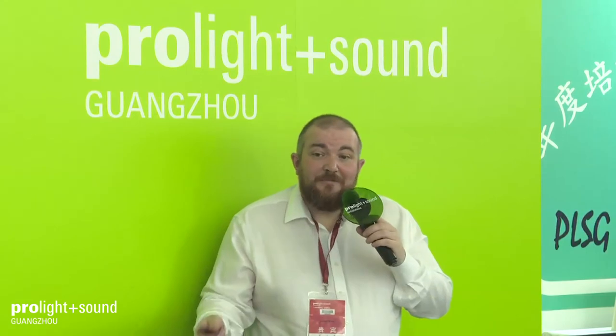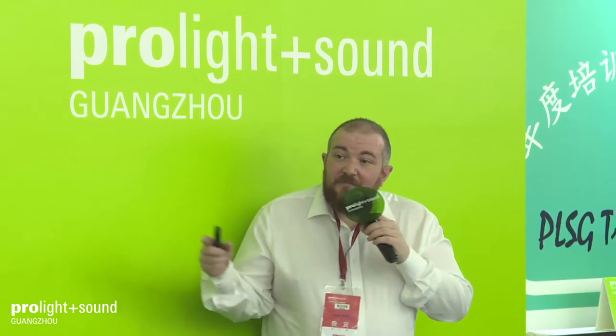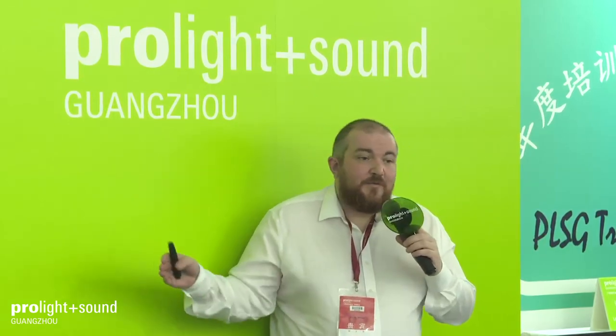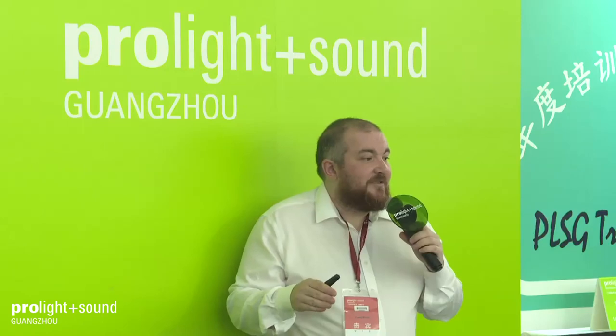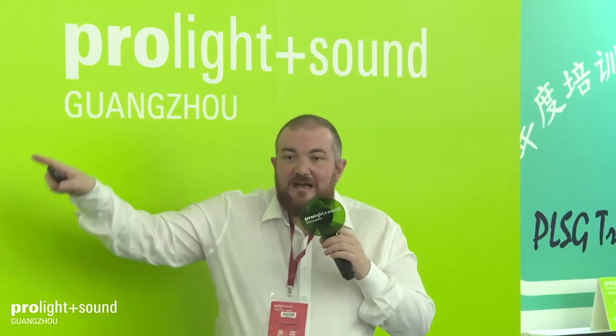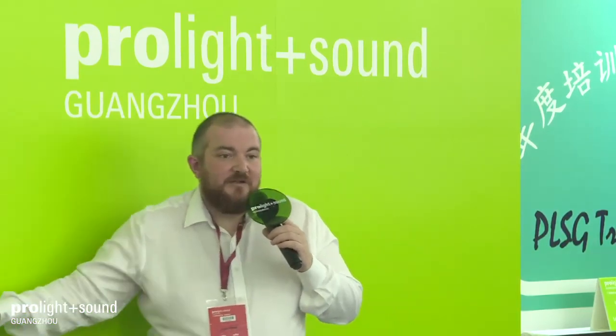So we have our port addresses, which are our pairs on our multicore, our IP addresses, which are like having many different multicores. And then right at the bottom, we have a MAC address, which deals with how we get that stuff down to the next layer onto the wire. And this ultimately shows us which interface we're going to leave our device by. And as we can see, we put these things progressively, and progressively our message gets bigger and bigger with this addressing information. This is something we call encapsulation. And it's something that we've also been doing for thousands of years.